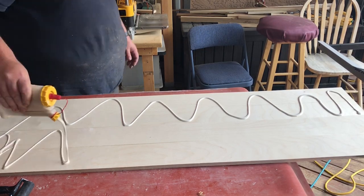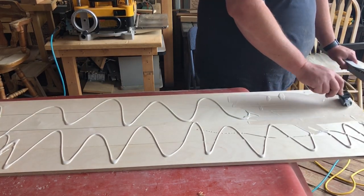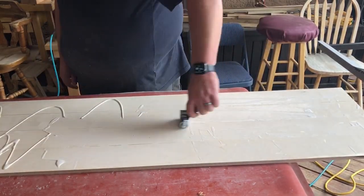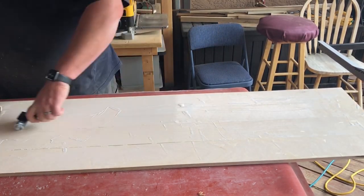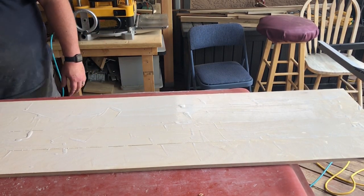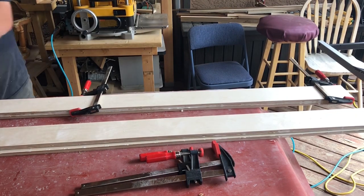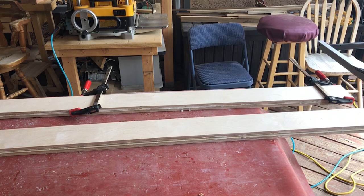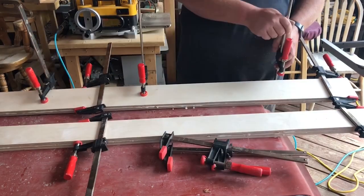I'm going to laminate these together. The trick here is I want to make sure I get enough glue with no voids at all. I'm going to lay all four pieces out and spread as much glue as I can — I probably use too much, but it's better to have too much than too little in a situation like this, because you definitely don't want these to start coming apart and throw off your straight line. Make sure you get enough glue and then clean up the squeeze out after you get it together. I know it looks like I'm putting the clamps on wrong, but I picked this trick up from Nick Ferry — I'm just putting the clamps on there to pull the two pieces together so they're perfectly flush on the sides. That way, when I put my clamps down to actually hold them in place, the glue won't slip them around when applying pressure.